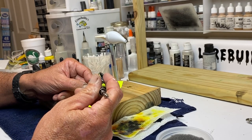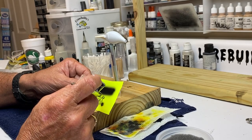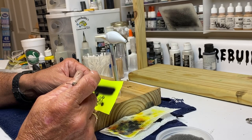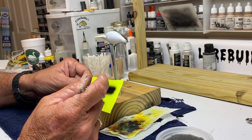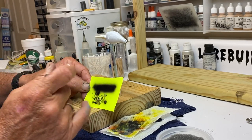The trick is learning this trigger right here. If you pull back with the air pressed down, you've got your air coming through and you're pulling back and no paint's coming through — most likely your paint's too thick. It's not going to go through the needle or bypass the needle. If you've got it too thin, it's going to spiderweb on you.